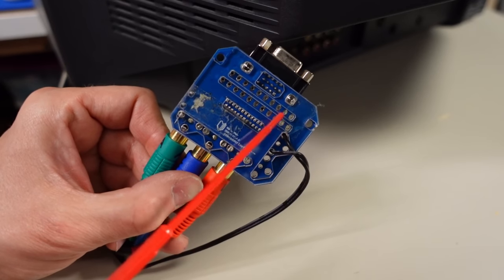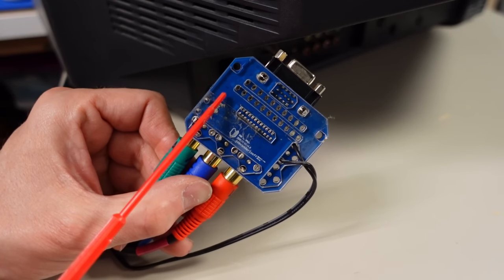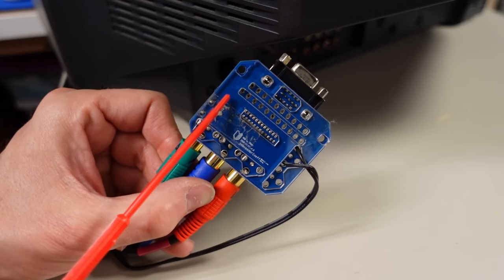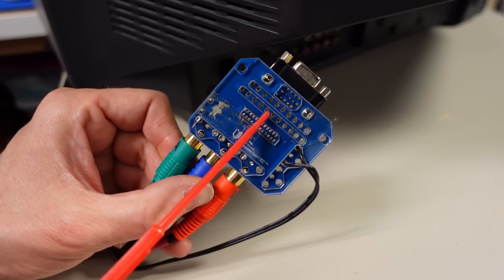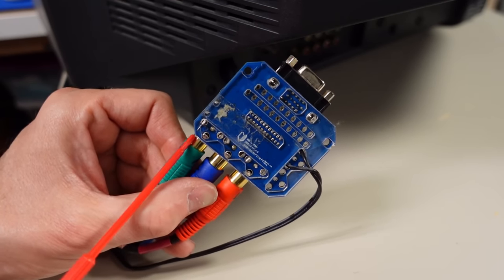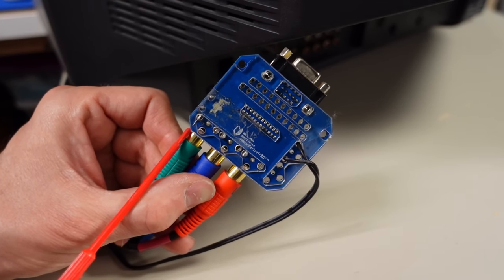You may also notice there is a SCART footprint on here, because I think in Australia, it's also not common to get SCART televisions. They exist, they're just not super common. So this adapter is probably useful to Australians. Well, it would have been if you could still buy it, because you could hook up SCART devices to it, like game consoles or whatever, and get a really high quality component output for hooking directly up to one of your televisions that only has component inputs, just like these North American televisions.